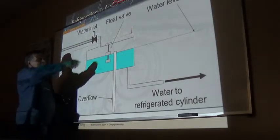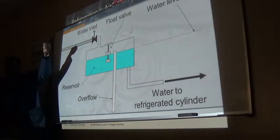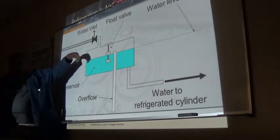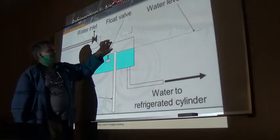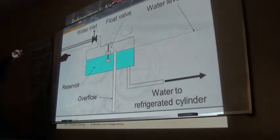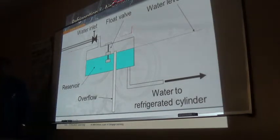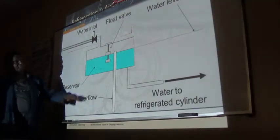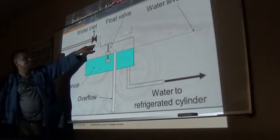These are easy to change. On the top, you just twist it about 90 degrees and lift it out. There are two wires coming off of it - it's like a cap on top of a soda. There are two wires coming off it with male or female ends, depending on what it is, and it goes right up into the control box onto the board. Everything is modular. They come with Molex connectors where you just take the connector and plug it into the controller. We have electrics to the float to control this solenoid valve.